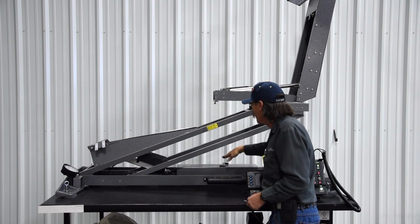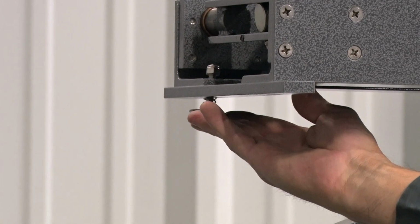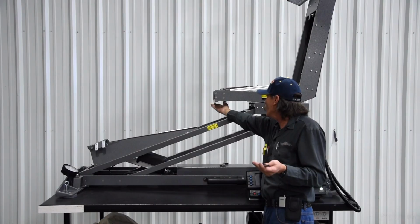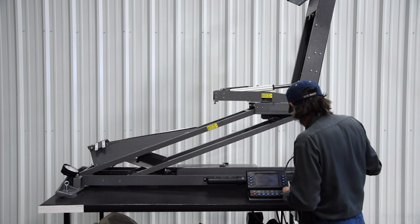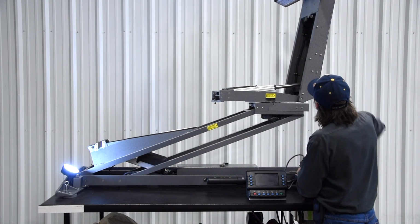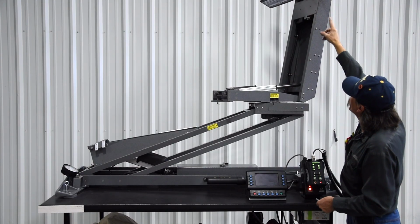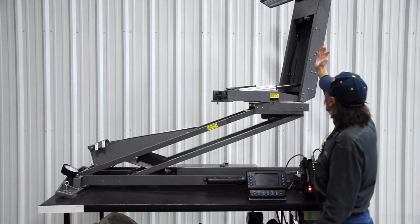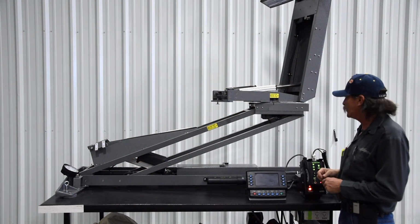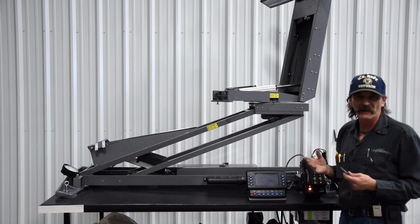As these come down, it will pick up the contact surface of this. They're spring-loaded, so if they're adjusted down just a little bit too far, it will allow a little bit of give before it crushes the sensor. The other one is located up into the tree. It is a fixed one. The nest saddle and everything landing on this point here will not allow that to come down any further, but they can all be adjusted down to pick up the sensor range needed.